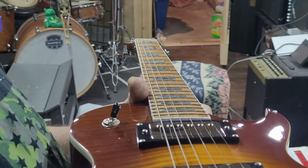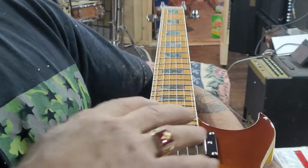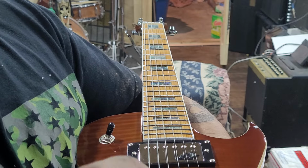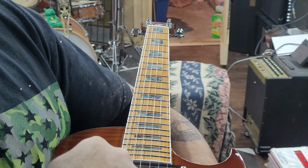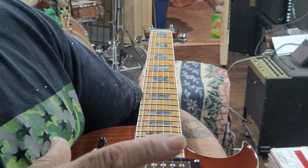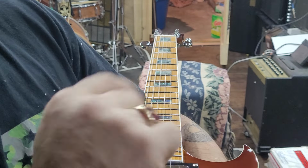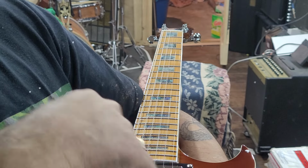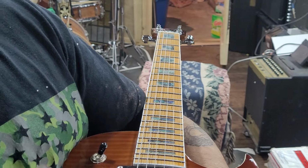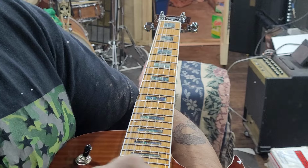I have this thing, right? I see guys taking and checking them out, you know, they take the pickups out. Well, here's my thing. When somebody puts this together for the first time, right? And this is how I work. What I do is when I build a guitar, I'll put them in, I'll take them out, and then I take some super glue and put it down in the holes. Then I let it set up for 24 hours, and then I'll put it back down in there, because I know how people like to change their pickups. You could put some epoxy down in there too, you'd just have to make sure it's in the threads and doesn't expand past the threads. It strengthens those holes for those mounting screws. So that's something for you to think about if you never thought about it. Sometimes they get these a little too close to the inside of where the router had cut it out, so you got to be careful about that.